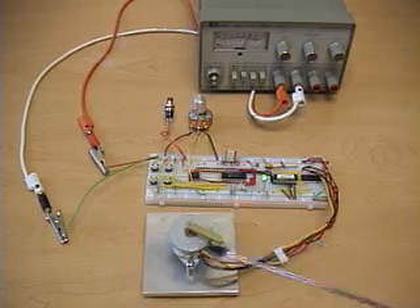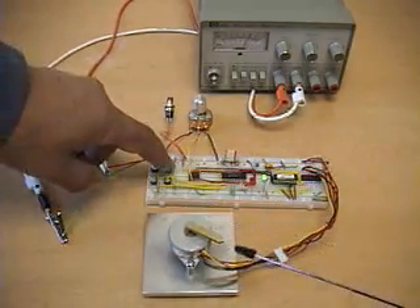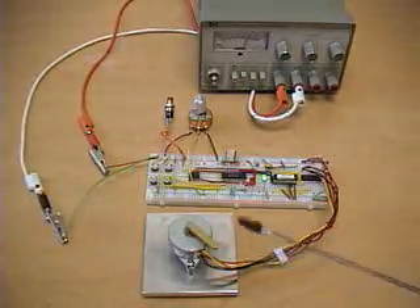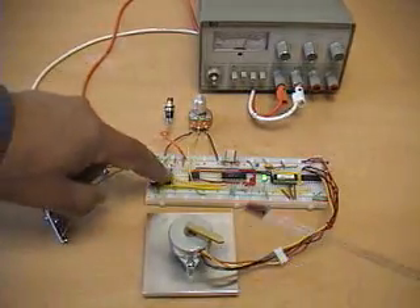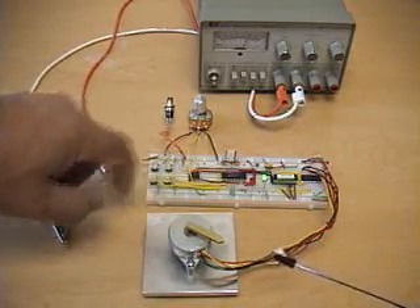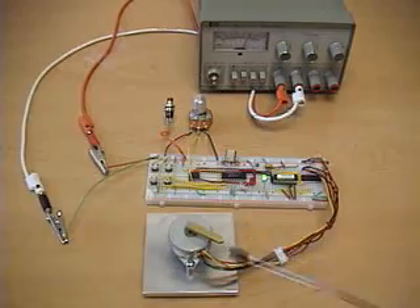It's important to note that if you try to move to the positions starting at zero speed and immediately go to that fast speed, it cannot track properly and the motor does not move the full 45 degrees or in this case the full 180. It just buzzed in that one place because the motor is stepping too fast for the rotor to respond.